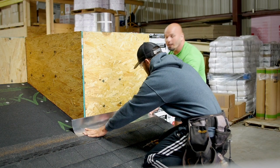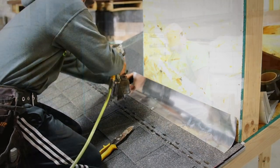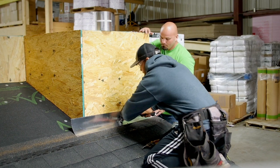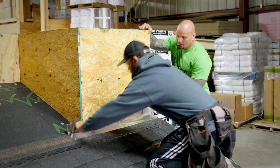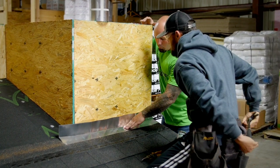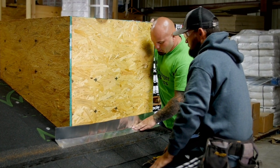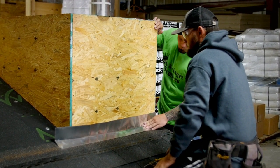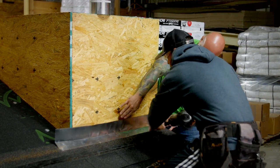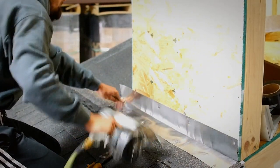You'll take your hammer and nail it down first. Then you'll take your hammer and stick it as far as you can in to create the line — this gives you the contour of the wall. So if there's a little dip, a bow, or whatever, you get it on every one. On roll flashing, we always attach even though it's not preferred, but we have to get these wrinkles out. So we'll put one nail here, one in the middle, and one on the far side.